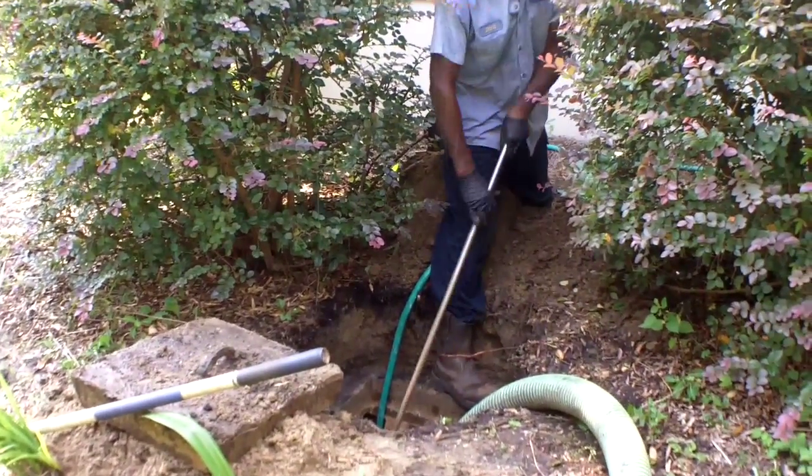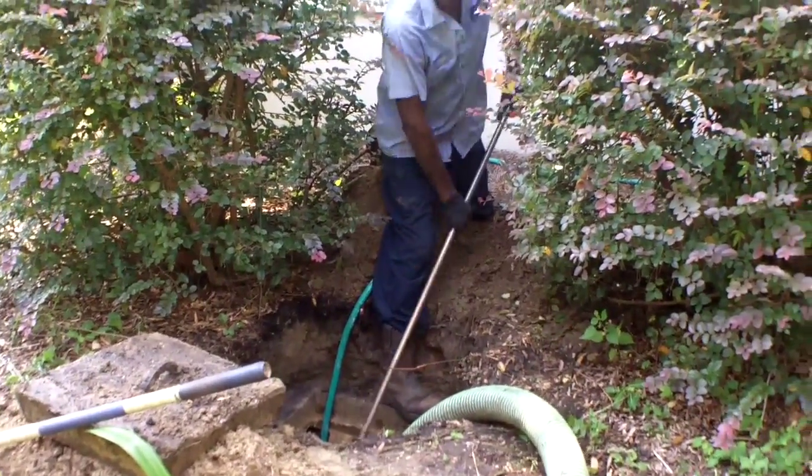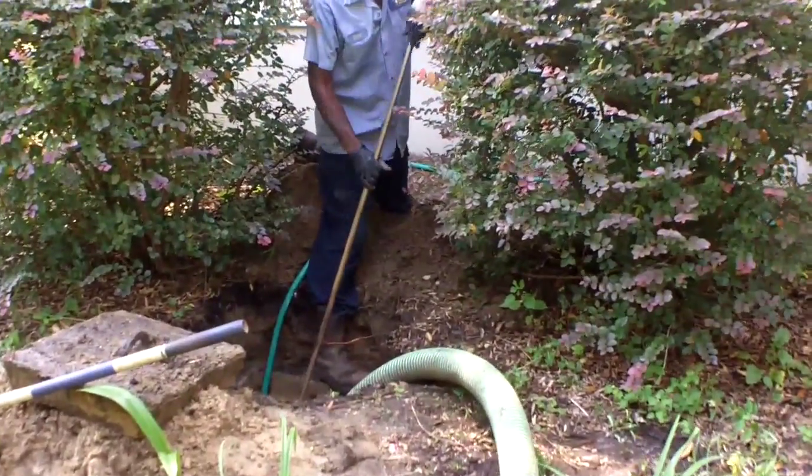It's just about empty and they'll be doing the rest of the inspection here in just a minute. They just asked the seller to go ahead and flush the toilet with some toilet paper in there so they can see it as a marker as it flows through — just to make sure the flow is okay. Now they're down there with a flashlight, looking down in there and checking the walls and checking the outlet area to make sure everything looks okay, no cracks, nothing unusual.